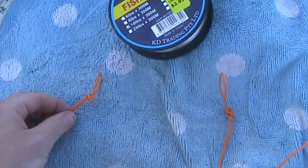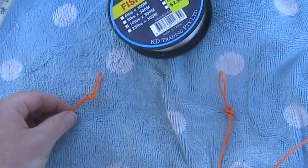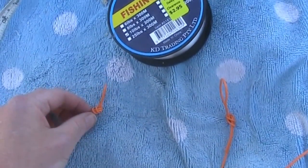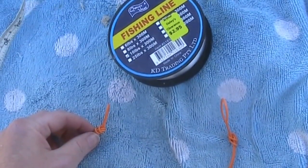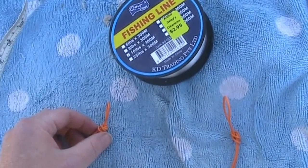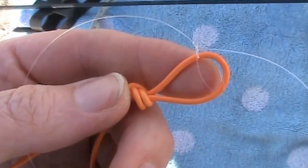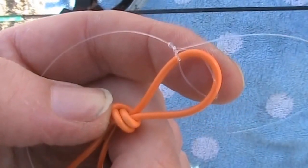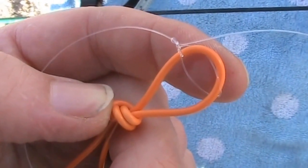The tops of the two elements need to be around 50 centimeters from the vertical pole. Because the fishing line I'm using to support will be angled, that requires around one to one and a half meters or so of line. Fishing line is nasty stuff that bites into thin insulated wire, so if I had my time again I'd probably use string instead.